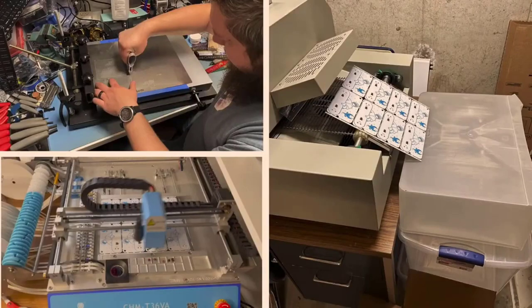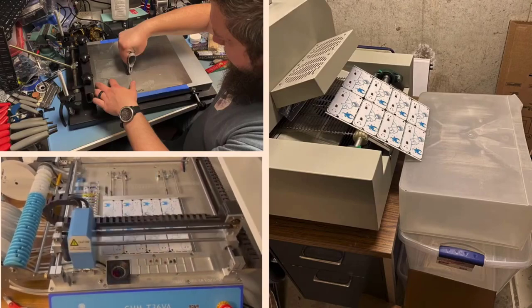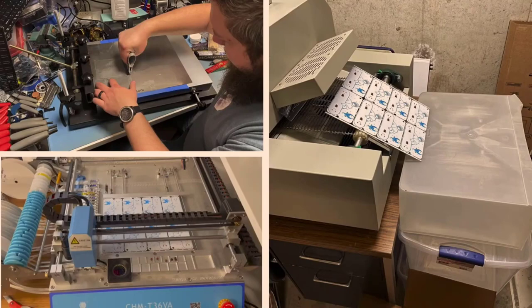I have to give a big shout-out to Compute Kid Mike — he did so much for us. He did the assembly of these badges. We didn't have enough time to have the shop in China do it. He's got a little pick-and-place machine that grabs each part, puts it over a light to check how it's holding it, and then places it on the board. You apply solder paste through a stencil, the machine sets the parts on that paste, and then his big pizza oven cooks the solder paste into solder. Really cool to see — never wanted to do it again.